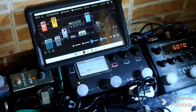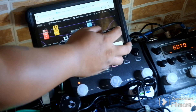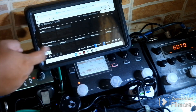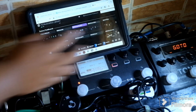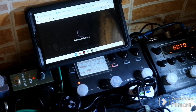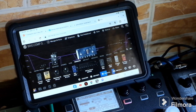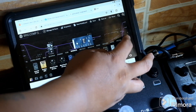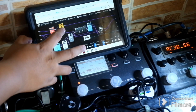The first feature is connectivity — you can connect the MOD Dwarf to a tablet using a Bluetooth dongle. However, take note that not all Bluetooth dongles work, so check the forums for that. You can also connect it to a PC or Mac via USB cable, and from there use it as a web server with your browser as the client, just typing in the IP address to see your digital pedal board. Note that the Bluetooth IP address is different from the USB IP address.